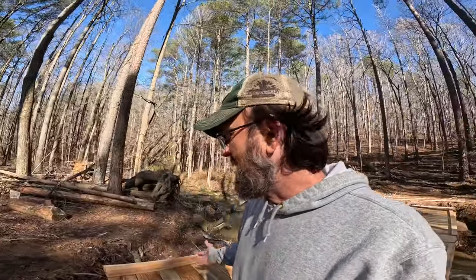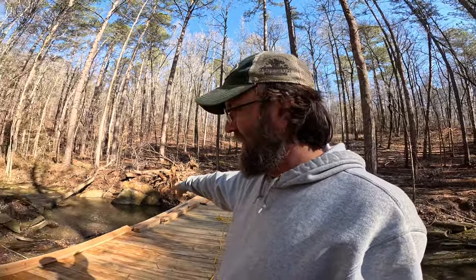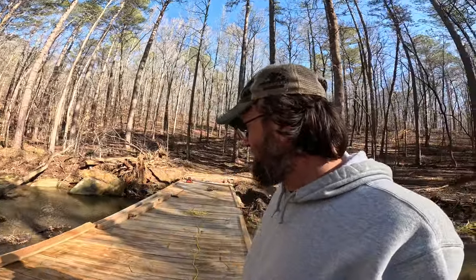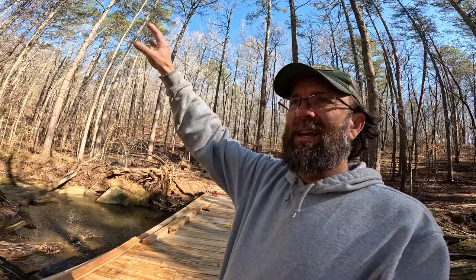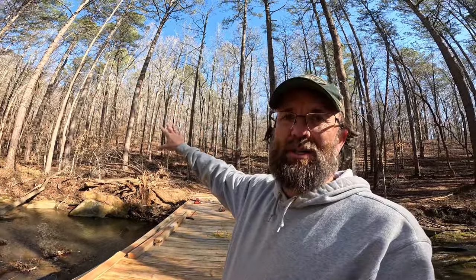This isn't really a lot of framing, but I am down here by myself doing all of this. So that's gonna be a little bit of a factor on the speed as far as what all I get done. So let's get at it. I've got this one laid out. I just need to start cutting my 4x4s to length, installing them and bracing them. So we're gonna do 8.5-foot tall ceilings and then 2x8 header resting on top of all of that. So let's get at it.